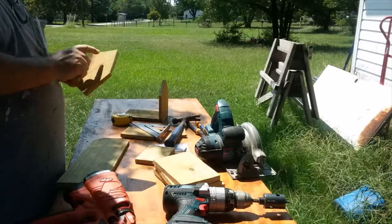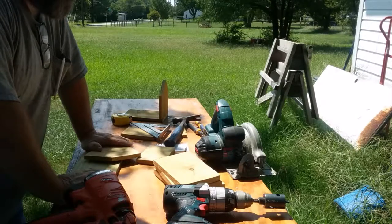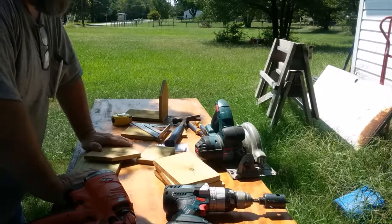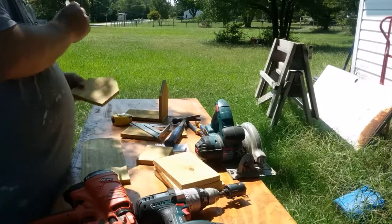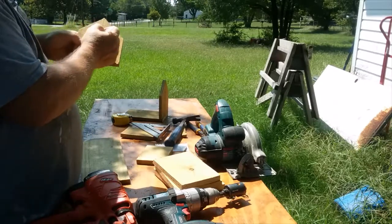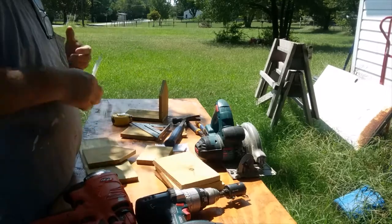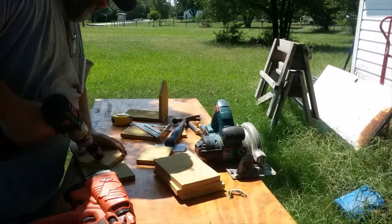Now, before you put the front on, we want to mark and drill our birdhouse hole. Typically an inch and a quarter is fine for most birds like sparrows and finches. If you have bluebirds, they recommend an inch and a half hole. I think if you're out west you've got the big fat bluebirds — inch and nine-sixteenths or five-eighths. When those fat birds really want in, they'll lose weight and get in an inch and a half hole. I normally just go across from corner to corner and find the center — I'll put it right here, so half is above the imaginary line and half below. You can do this before you cut the boards, which is easy, or you can do it afterwards. This is not rocket science, folks.